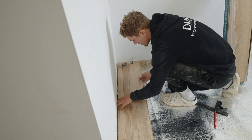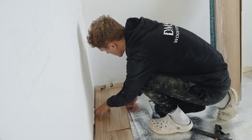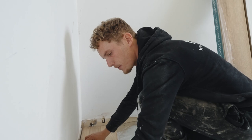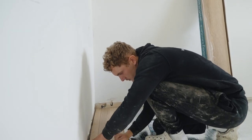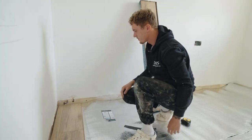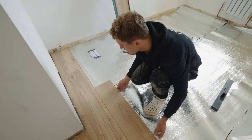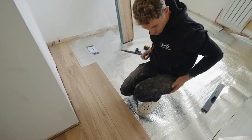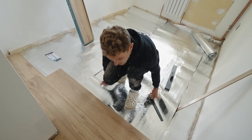Watch out. Into your long join first, because that just makes your life easier. And once you're fully in, you can use a knocking block if you want, but with these, because you've got nothing to stop it unless you've got a couple of wedges in, you don't really use a knocking block. The shoe's good to go. Get a PVA in there, maybe. I'll start with my full one there. I don't like my joints matching up — I'll either find a short starter or just randomly take that off.